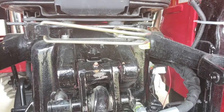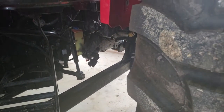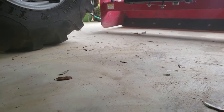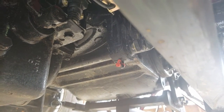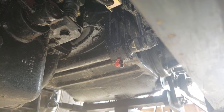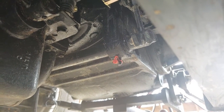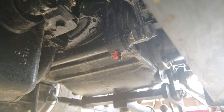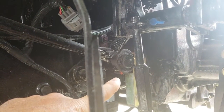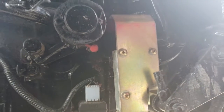We've got two more to look at. Back on the left side of the tractor — this is our left rear tire — you come down to the bottom and you can see I've got a red Zerk fitting there, that's number eleven. Now remember how I told you the hydraulic suction filter grease fitting was hard to find? Well, there's another hard-to-find one, and that's for the clutch — not the dual clutch, but the clutch fitting. Number twelve is on your clutch. I've got a red cap cover on it back there. You can see the red cap in relationship to your four-wheel drive lever indicator. So that's the 12 grease fittings — but if you don't know it, that clutch fitting is hard to find, to be honest with you.